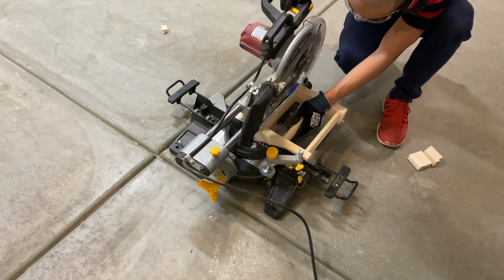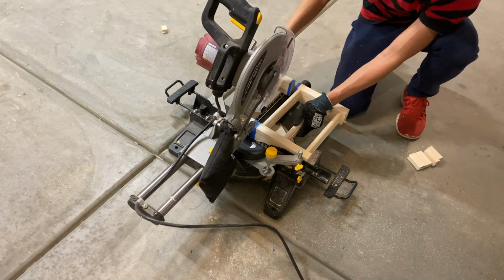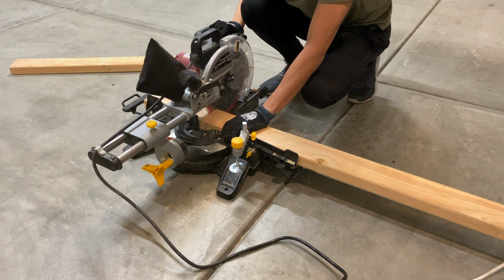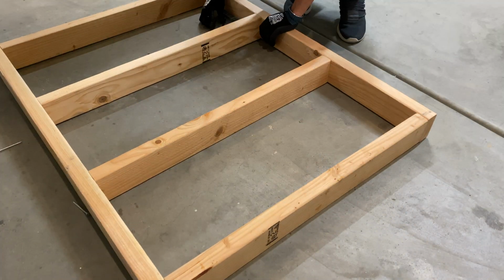Because the space is fairly narrow, I did have to cut down the racks from 3 openings across to 2 openings. I then started building my frame out using 2x4 wood to close off the island. I used construction screws to hold everything together. I got all my materials from Lowe's.